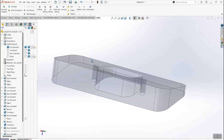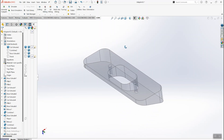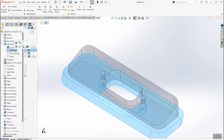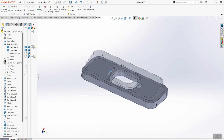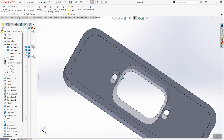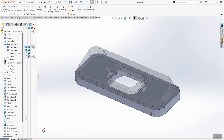Taking a look in SOLIDWORKS here, we can see this is a very roughly modeled up wedge mount. I measured and modeled the important stuff — the perimeter, the location of the holes, and this big clearance slot are all pretty accurate. The rest of the bracket is a little bit different in reality, but that doesn't matter. Based on this, we modeled this quick and dirty little spacer plate. I got slots instead of holes because when we're machining we're going straight up and down — we can't machine on an angle. So I just made slots so that slot lines up with those clearance holes, and that's why we've got a slot on this side too.